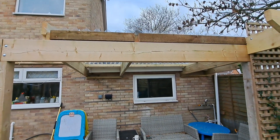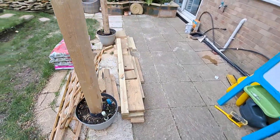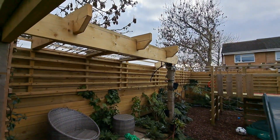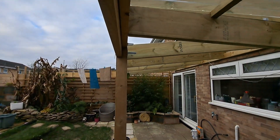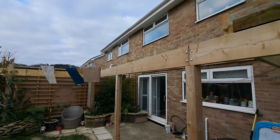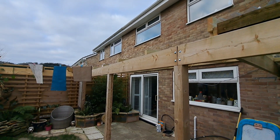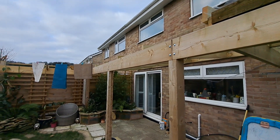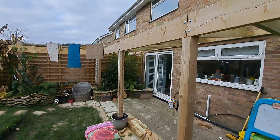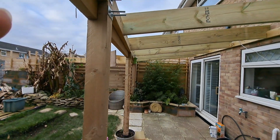It's all screwed down with a couple of little finishing touches to do — where you can see the end of the roof and things like that. I won't know until it rains what I need to do, so we'll test it then. The next thing is these little off-cuts here. I need to cut out all the overhangs — that's all one bit of wood and horizontal. If I'd used one bit of wood over there they'd be at a slant, so that's why I've done it this way, leaving vertical bits at the end. I just need to cut the excess out, leave a little tail, and screw it down or use some little metal straps.